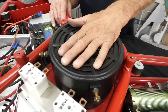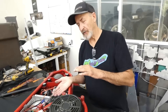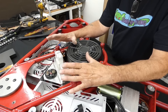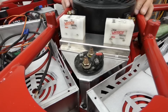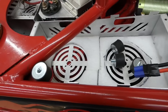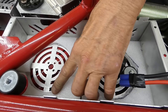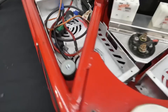The ME0708 modified is a motor that I designed for Tombstone. I shortened it by an inch and a quarter — it's the same ME0708 power-wise. We're running at 60 volts and we only use an on-off relay. We don't use any speed controls on this motor. We haven't found anything that was actually robust enough to stand up to the motor at what we're doing with it. For the battery boxes, I'm using the RacePow 8200 8-cell batteries. I run two batteries in series, and then another two batteries in series, and parallel them for the weapon system.